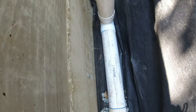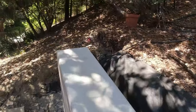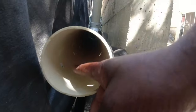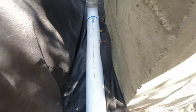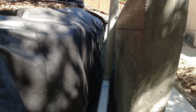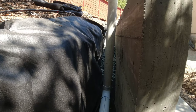This is a perforated pipe. You know it's in the right position when you see the letters up, as you do here. They have holes in the pipe underneath it — you can see the holes here. That's what they call the 4 o'clock, 8 o'clock position. So if you're putting this pipe down with the letters up, it's in the right position. The pipe is pretty much level with a small pitch to it, and the hydrostatic pressure is going to push the water out.